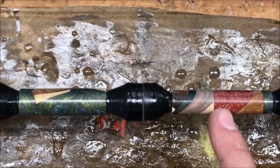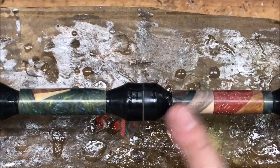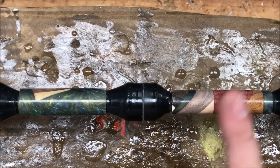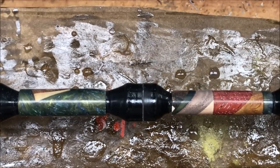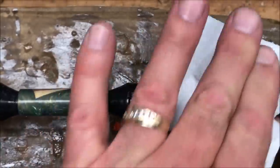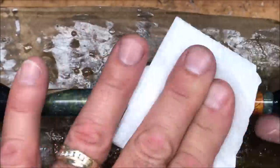The CA has had plenty of time to dry. I'm going to go ahead and aggressively micro mesh these blanks with water. I want to take the CA finish off the surface of the blank, but hopefully the grain soaked in the CA so that will help protect the blanks from the moisture. I just finished the micro mesh — the blank looks really good. I don't see any scratches down around the edges or anything. It looks nice from end to end. There's one little dimple right there in the fill from the air bubble, but I don't think that's going to cause too much of a problem — it'll fill easily.